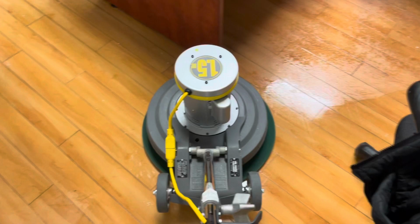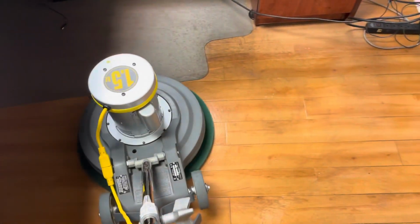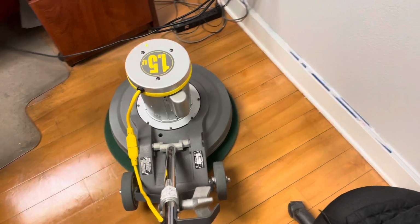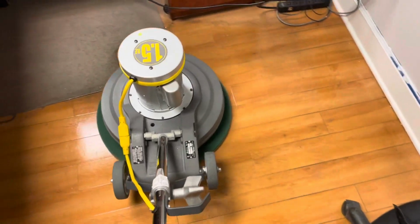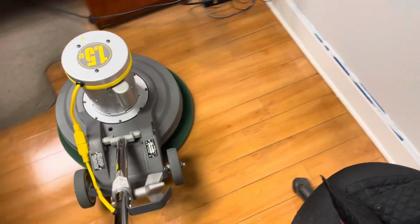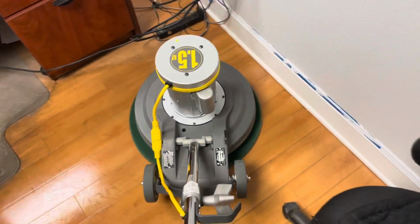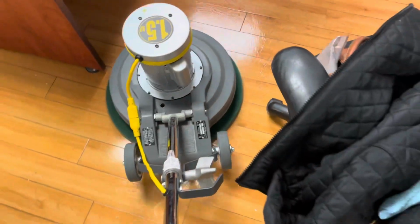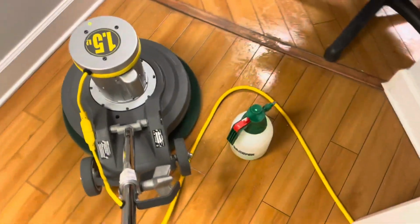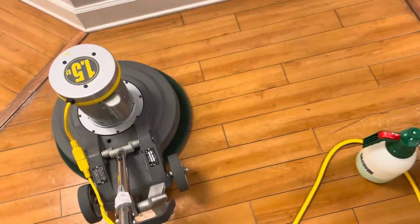And as I said, we neutralized the floors when we're done with the mopping of all the floors. Make them look better when they're done, and just so they're not sticky and full of residue. And we used a solution, a little bit of Murphy's oil, for essentially like a surfactant. Since it has a higher pH, it's good to just kind of give it a little extra cleaning power in our solution.